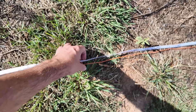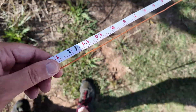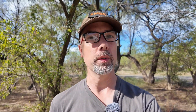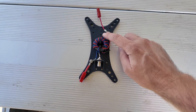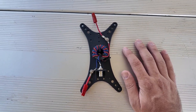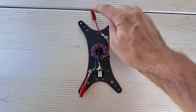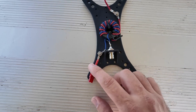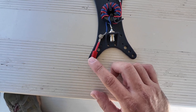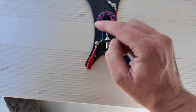Counting down — 43, 42, 41. If I pull them both equally tight, I can cut it right there on the 41-foot mark. That leaves us plenty of wire left over for our counterpoise, or even more than one counterpoise. I know I've been accused of being a madman, but hear me out — we always encourage customization on our antennas. I have delusions of grandeur that someday I'm going to put a shorter wire on this and test it out. Right now we spec a 41-foot wire for this antenna, and I have the ability to attach my 41-foot wire to the power pole connection.